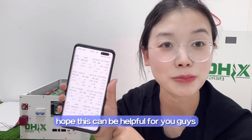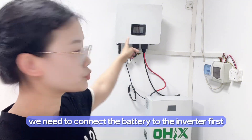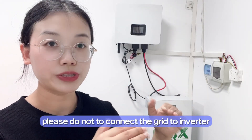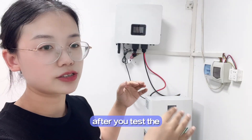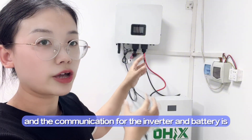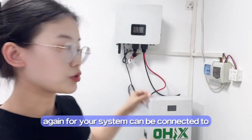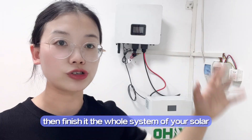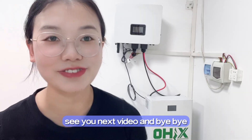Hope this can be helpful for you. After completing the above operations, connect the battery to the inverter first and test that the inverter output is okay. Please do not connect the grid to the inverter yet, because we don't know the inverter output status. After you test the voltage output and communication between the inverter and battery, disconnect all settings and reconnect your full system: battery to inverter to grid, and if you have a solar system, connect it to the inverter. Then you have finished the whole DIY system setup. Hope this information helps and that every DIY project works well. See you in the next video — bye-bye.